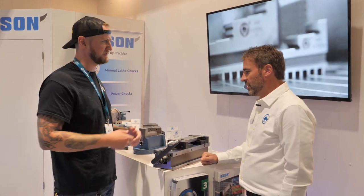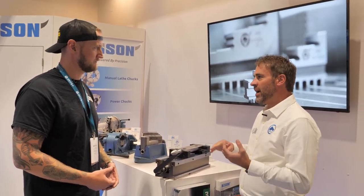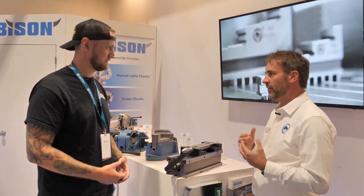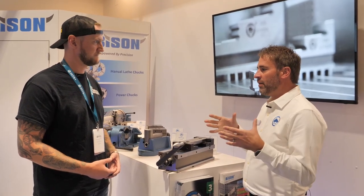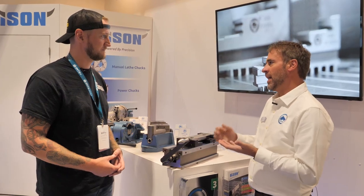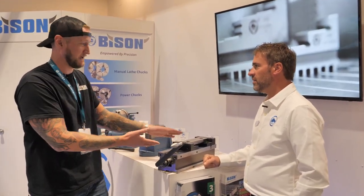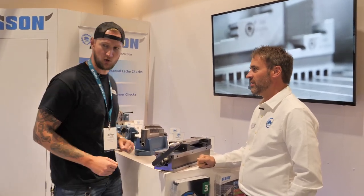What kind of shops are putting this in? Guys doing big steel parts, heavy cutting, mold shops doing a lot of contouring who don't want the part to move. It's also great for shops with more delicate parts, allowing you to control exactly where the clamping pressure is — clamp too hard on a delicate part and you'll get a huge bow in it.